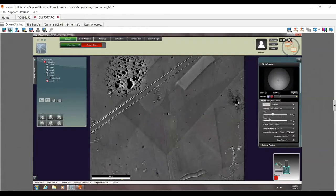What I mean by that is, right now, let me go ahead and lower my gain a little bit. We're going to see this value right here. This value is basically a camera saturation index. It is basically the well depth of the highest pixel in the camera. So right now we're using 30% of the max dynamic range of this camera.